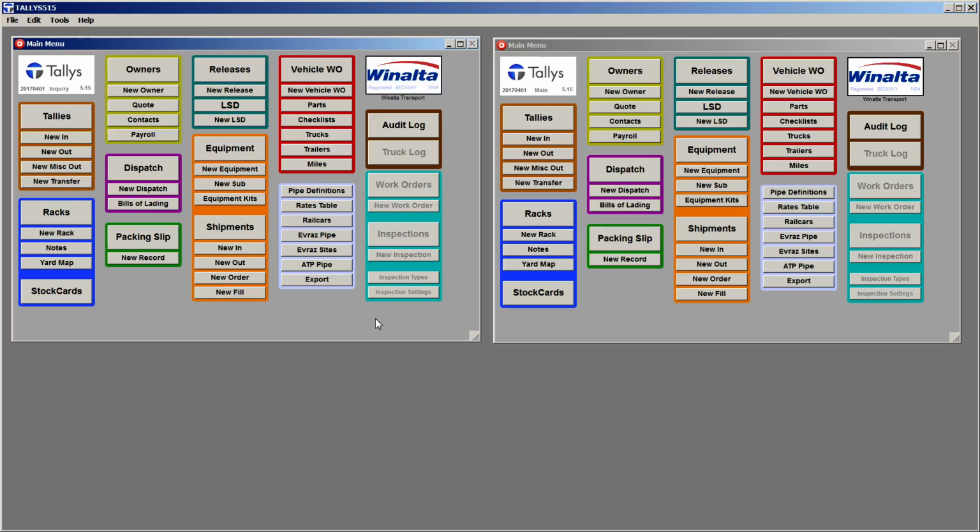So that's a brief overview of how we can put in a double check into place. We check our laser measurement coming in. We change anything that we're not happy with. If we get one of those 1.2s or 4.8s that we've been having, change that. Save that column into a new folder, making sure it's saved as a tab text delimited file. Save that file to wherever you have your measurements, and then do your tally.